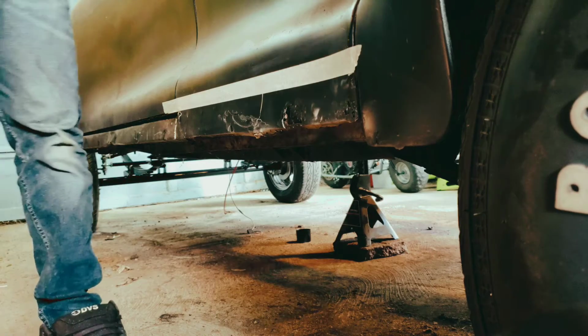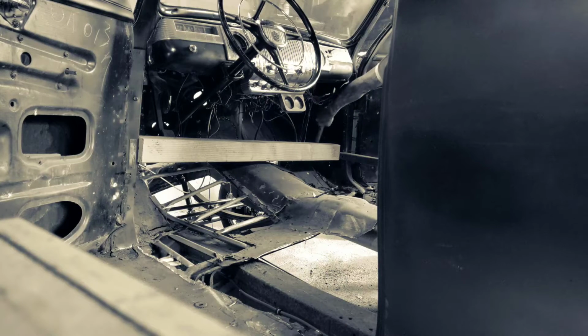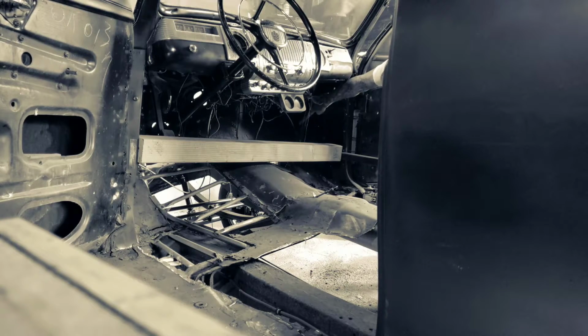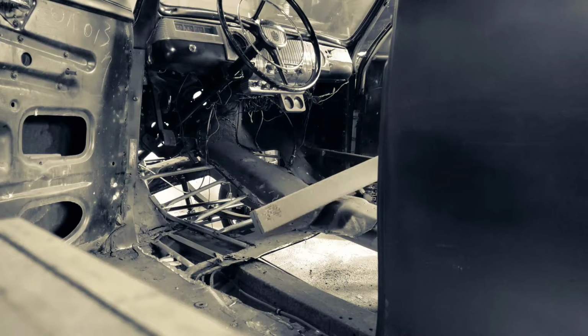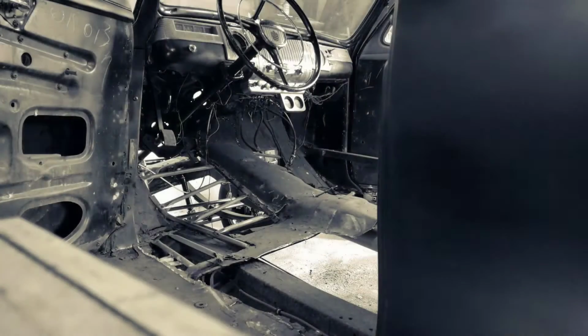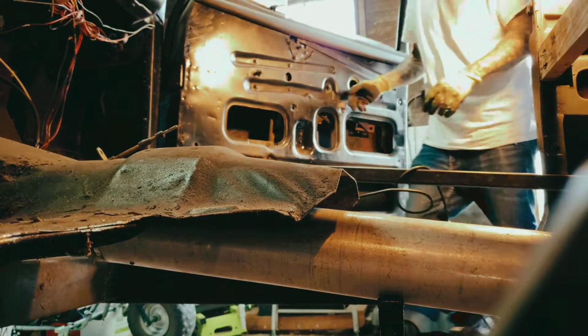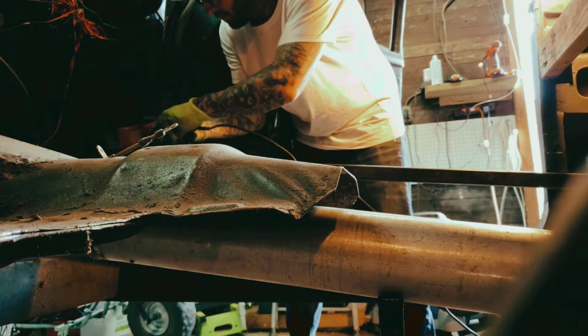I thought that this was all metal down here, and it is all metal, but it's just underneath about an 1/8 inch of mud. But I had to take the supports out because they weren't necessary anymore after I put the structure in. The reason I had to take that main one out first was because it was up against the support that was going across the front door on the other side, and now that side's done, I needed to zip off the bar and weld it onto the other side to hold it from twisting or anything while I do that rocker panel.